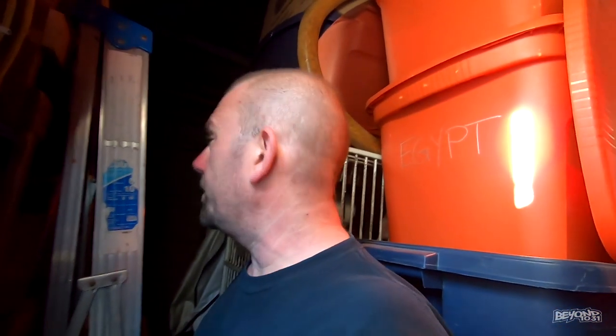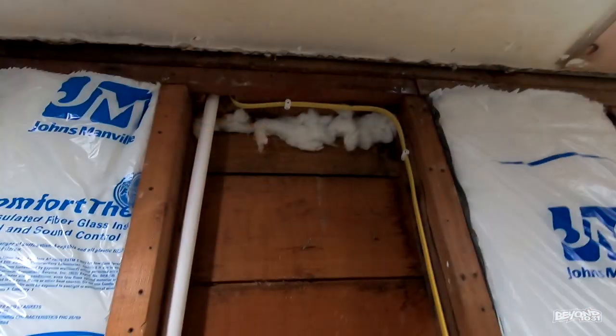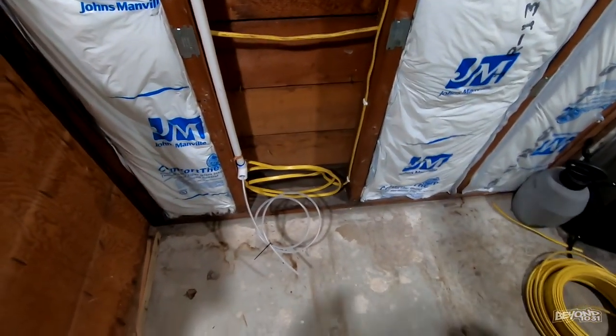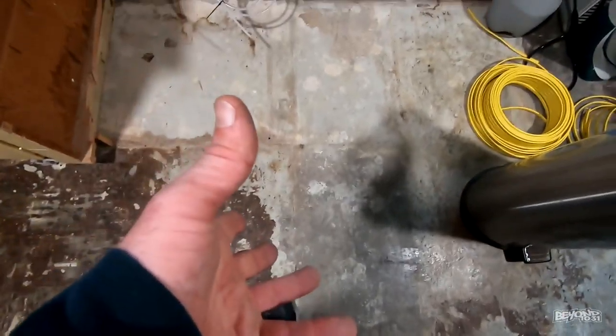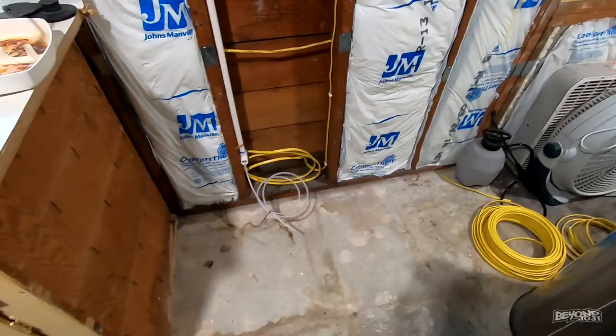And then everything was dark and quiet. Now I'm going to put on some rubber gloves. Why? Because these wires are still alive — they come from the power meter. It's dark in here. I'm going to put in this breaker, wire it up, and then go on from there. Look how neat. I'm doing everything as neat as they did it when they switched out this power meter years and years ago. And there we go — all ready for the dishwasher. Extra lead cut out, comes out to about right here. There's plenty there to hook up to the dishwasher before you put it back in. That's done. One more done.